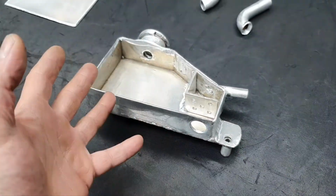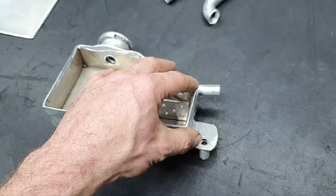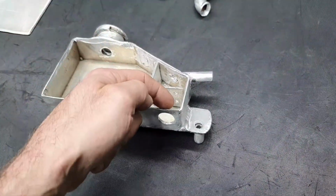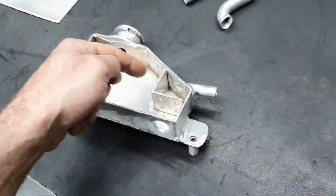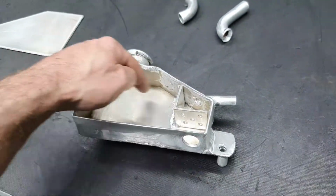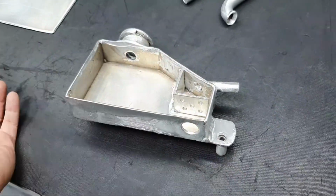Fine. So you can create air bubbles from the tank. It's simple, I think, because if you put the fluid inside, even if it's completely empty, you start the car, you're going to see some bubbles, obviously, because the whole system is empty. If you turn it off and leave it to relax, to let all the bubbles come out, and then you top up the fluid properly, that's what I'm doing on the Mercedes all the time.